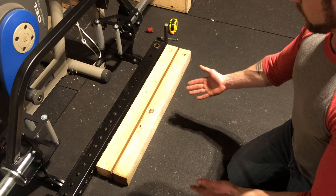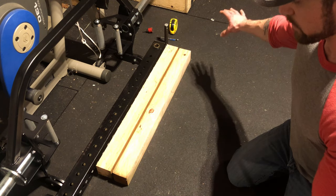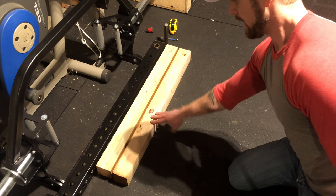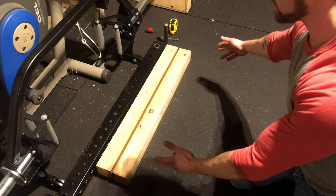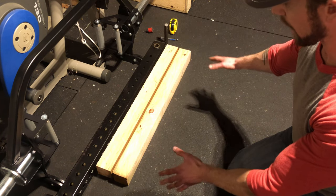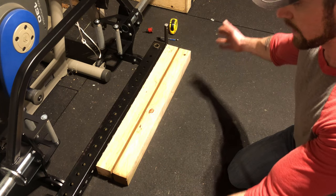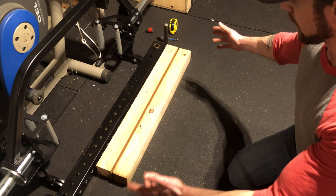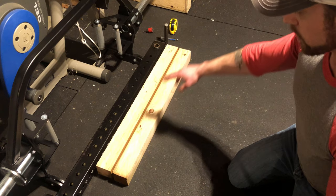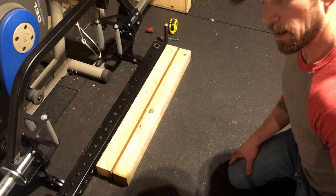So if you haven't seen my DIY Frankenstein rack, I make 3x3 uprights. So what I'm gonna do is, and I've already cut these 3x3 and shaved them down to 35 inches long, which is what the shorter arms are, I'm gonna actually make some slinger arms, which I wanted to do anyways, just to see if they would function well so I could do some stuff inside of the rack and not have to be outside of the rack with the longer ones. But what I'll do first is I'll cut this thing, and then I'll put all the holes in it, we'll do one, and then I will show you guys the other option on the next video.